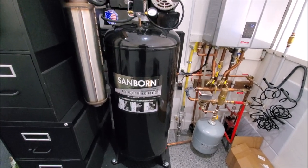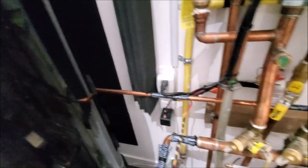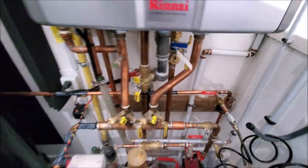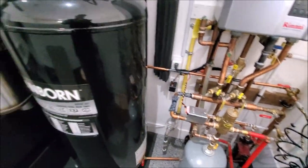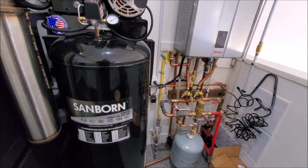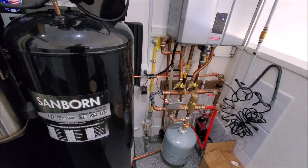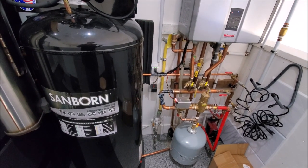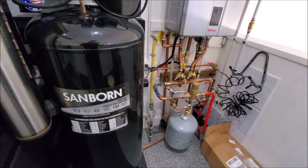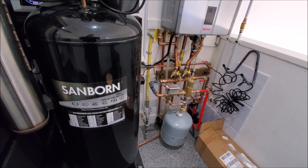Today we're going to do a quick overview of what we have so far in the system laid out. While we're at the top, you might notice that we have copper lines — the entire system is copper all the way out. I did have to purchase copper when materials were on the uptick, so it cost a bit, but I prefer it because it lasts longer, we don't lose PSI over time like we would with rubber lines, and it dissipates heat a lot better.